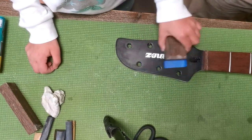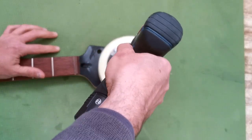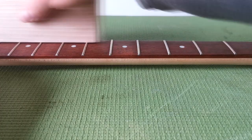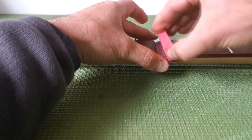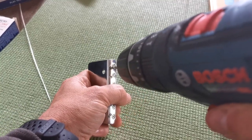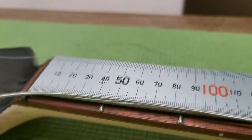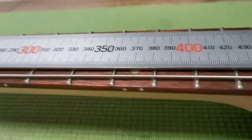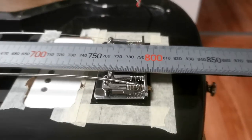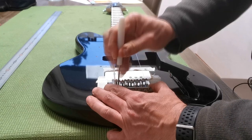I commissioned my daughter to help me with the flat sanding. You can see me using the actual blocks I talked about earlier, using the polishing tools and compounds, checking, leveling, and polishing the frets. Then I had to drill out the low E side because the string was just too fat for this bridge. I put a ruler from the nut and measured out to the 12th fret — it's 381mm — which comes out to a full scale length position of 762mm. I marked that out and have the two outer strings, low and high, positioned to set the bridge.